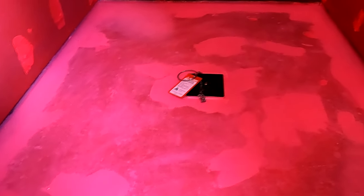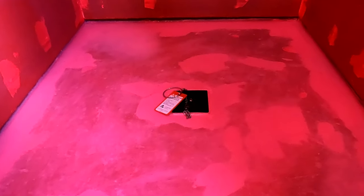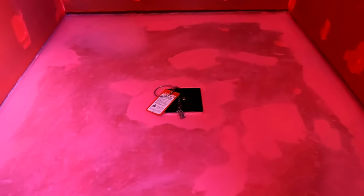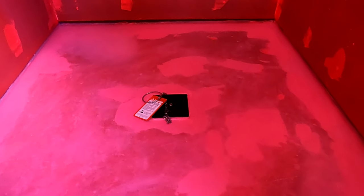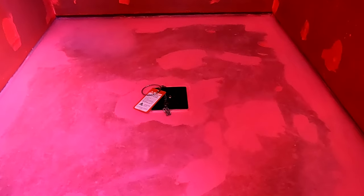Part and parcel to that was not just waterproofing the surface. There are two coats on here — if you did three, four, five, or eight it really doesn't matter, two coats is sufficient. I've done enough experiments with Redgard on cardboard boxes and sheetrock to know for a fact that this is 100% waterproof. But you have to be very conscious of the fact that your mortar bed has little places where your brush really needs to get into. If you read the directions on your waterproofer it'll tell you there's a certain mil thickness — you can go to Isaac's video where he follows directions and it fails, develops blisters or cracks.